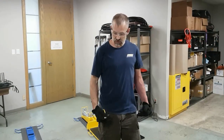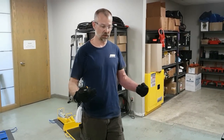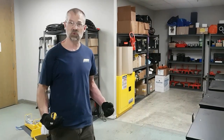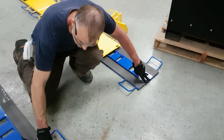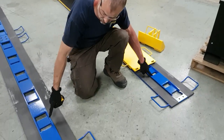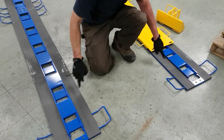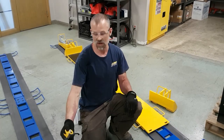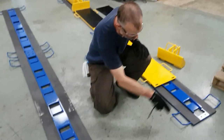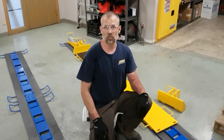These systems are also designed to operate synchronously, in unison. So when your cylinders are pushing on your load, you want your cylinders to be pushing on the load at the same time, or else you get uneven forces on your load, which could cause damage to the load or could cause binding of the slider plates into the tracks. So in order to make sure that the system is pushing in unison, you want to make sure that the end of the slider plates, when you line it up, are both at the same distance from the load, or equidistant from the load. If you can't do that, you've got to make sure that where your cylinder connects to the track, those are in line and equidistant from one another. Sometimes you might have an interference in one track line where you need to pull a track up a little further, and so the ends of the tracks aren't in line. But as long as you have the edges of the ratchets in line, your system will push in unison.